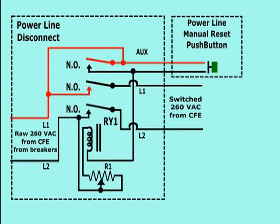When a blackout, or a significant drop in voltage, occurs in the power grid, the RY1 contacts are released, and regardless of the power coming back at the usual voltage immediately, the contacts will remain open, avoiding false starts or applying very low voltage to the compressor motors, which can damage them. During this time, the generator can be started manually and wait for it to gain speed.